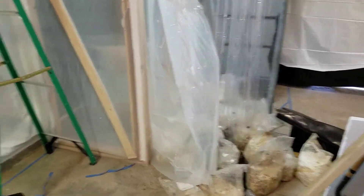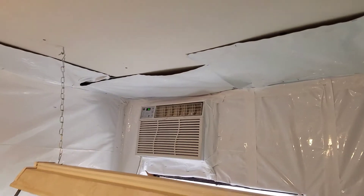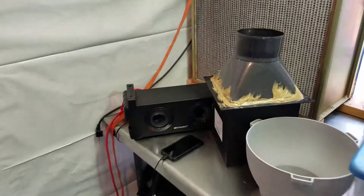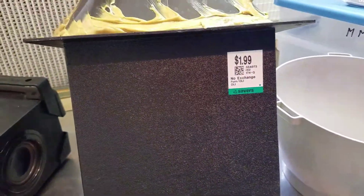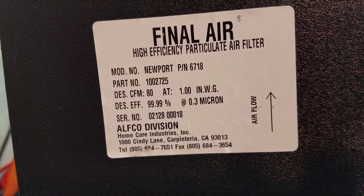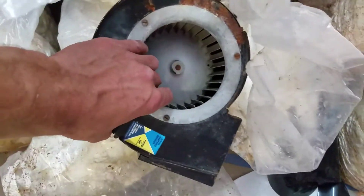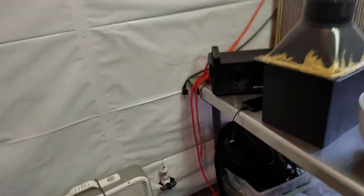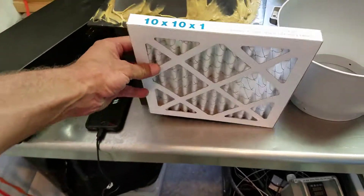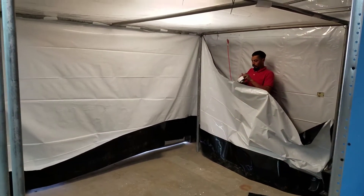Here are the flow hoods. We've got an 8000 BTU air conditioner up there. This is a $1.99 — no, $199 HEPA filter I got from Savers. It's a house-type final air high-efficiency particulate filter, so it's 80 CFM — this will be the positive pressure setup with a little 120 CFM blower. I also have a pre-filter for it so it won't clog up the HEPA. That's the progress we're making — hopefully we can get the grow up and operational in the next couple hours and have a couple beers.